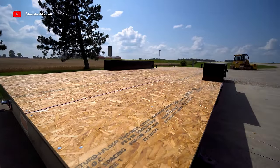And then I cut those pieces and fed them through the planer a bunch of times until they went down from about 3.5 inches square to 2.25 inches square. A bandsaw would work better if you have one, but I don't, so it really wasn't that big a deal for a 15 minute job. Then I cut these thinner pieces to length with 45 degree angles at each end. And it should fit in place here nicely like this.